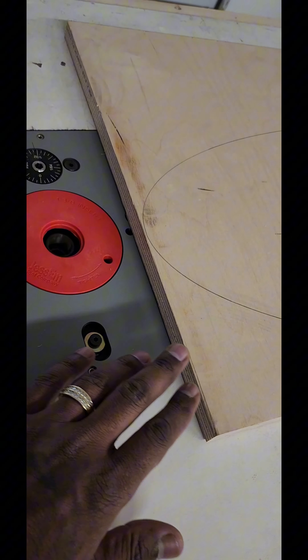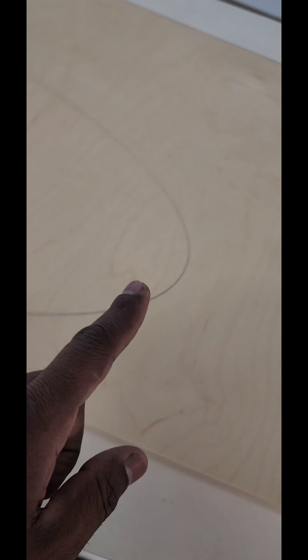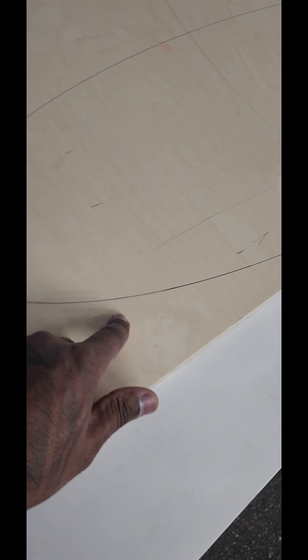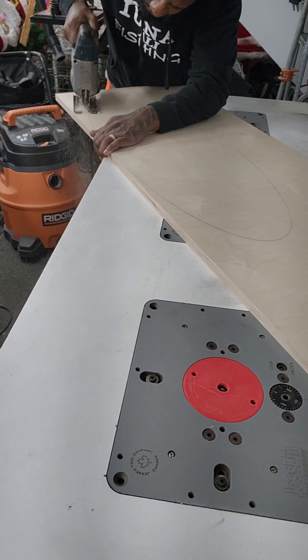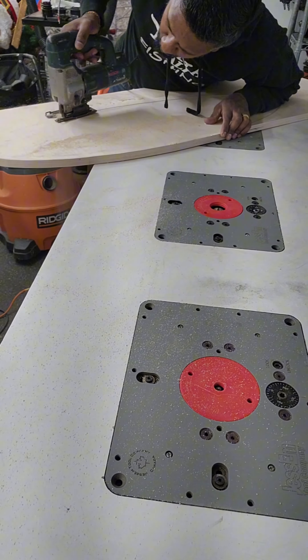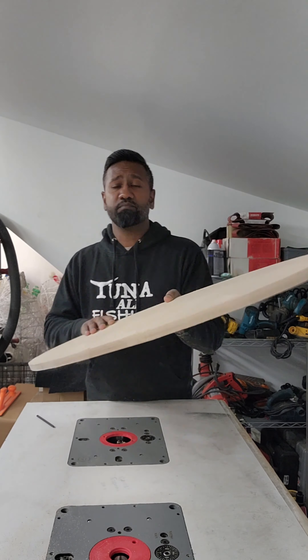We're going to start out with a piece of three-quarter inch — like I said, that's going to be our baffle. As you can see, I traced our template on there. There's a lot of steps I see a lot of guys skipping, which is called rough cutting. I see them stick their template right on there and jump into the router bit, and then you see a bunch of smoke flying. You spend money on your tools — take care of them. It takes literally a minute or two to rough cut this with a jigsaw. Please do.